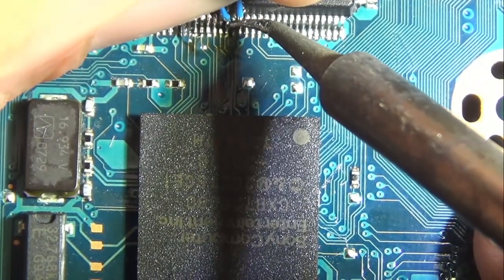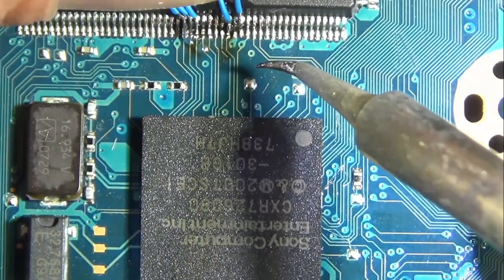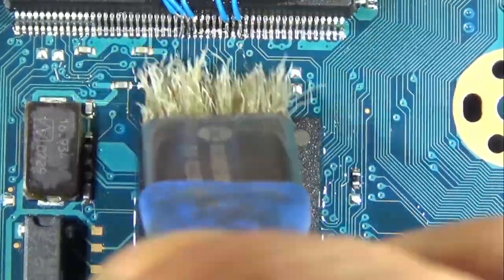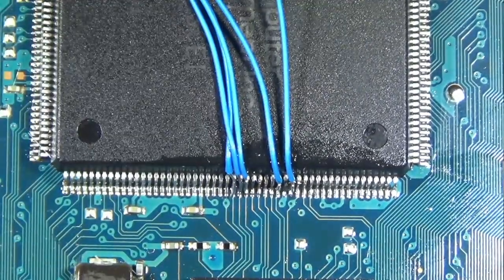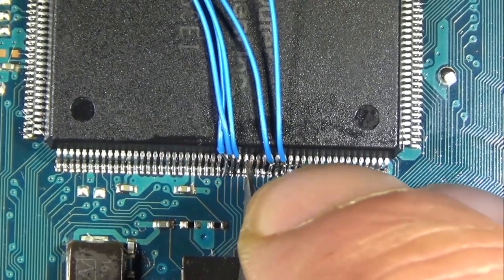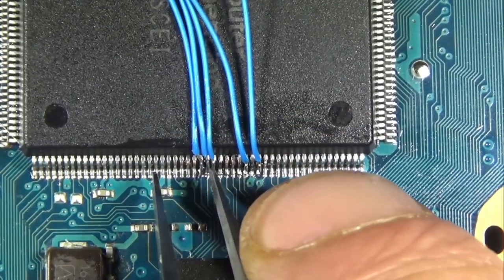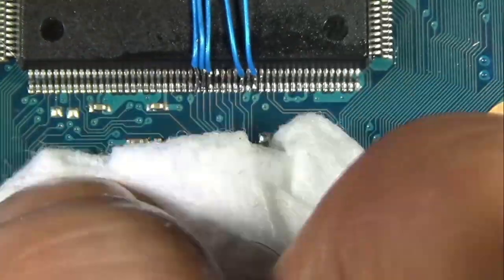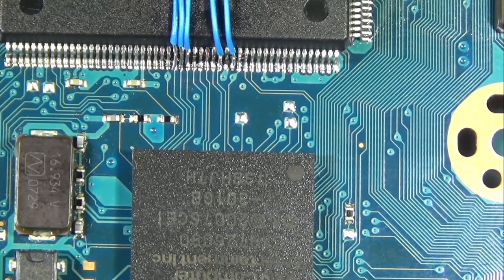Here's the big mistake. This is the A wire — it's one pin off. It's supposed to be one pin to the right, supposed to skip two pins. I soldered this to the wrong pin. Shoutout to Halo Slayer over on Twitter — I literally got pigeonholed and could not see my own mistake. Posted it on Twitter and he spotted it right away. Sometimes even the best of us need a second set of eyes. You just get too confident that you did everything right and you can't see a simple mistake. That furthest wire to the right is one off.